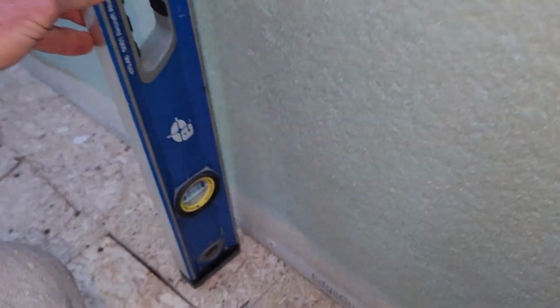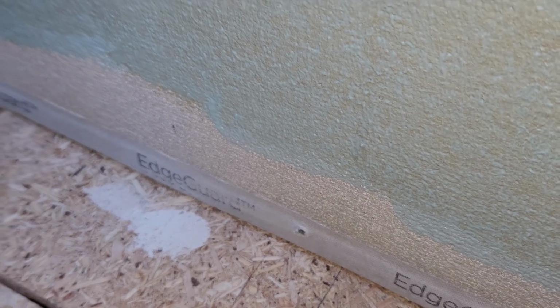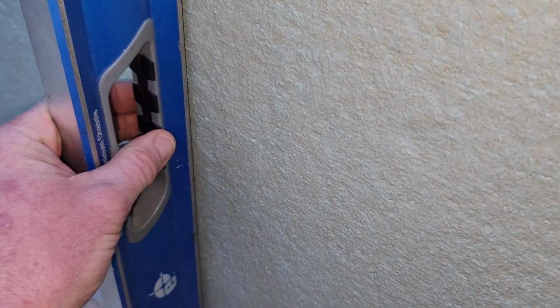So what happened in that case is probably my screw for my floorboards down there weren't plumb, and the screw just sucked in the backer board just a little bit more. And so I could either try to reverse that screw just a little bit to see if that backer board sucks out a little bit, or take note of that. And then what I would do is I would just add a little bit more thin set in that general area to match up with everything else.